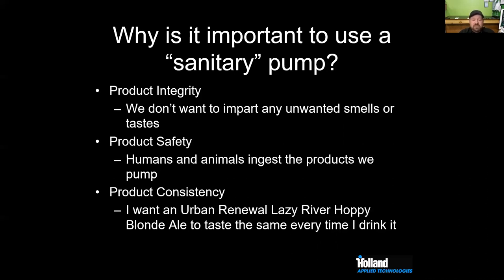The big thing is true isolation. So if you're cleaning a tank, you want to make sure that after your cleaning process, any remnants of product that was within that tank beforehand is not going to be transferred to another batch. This is particularly important when you're dealing with mixed cultures, like wild yeast and bacteria. That's the quickest way to get a systemic issue.